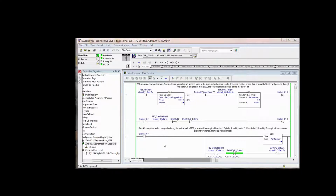Now, out on the shop floor in the real world, you would probably add more components to the system. In other words, you would figure out some way to buffer these parts upstream before they got this far, so it only released one at a time onto the feed conveyor when the system was ready to accept it. And you could simply do that by adding another conveyor upstream from the feed conveyor in your diagram, before the parts even get in the system, that has a stop on it. Or they're just buffered on that conveyor. In other words, you move one on, the photo eye sees it, it stops. You move one on, the photo eye sees it, you stop. And then at some point that buffer conveyor is full, now it's backing up, all the way back up to the previous station or the previous part of the process that we haven't talked about. We don't even know what it is upstream.